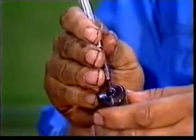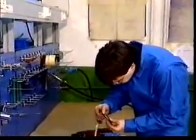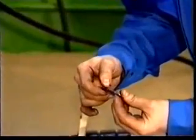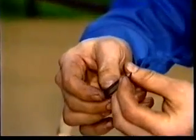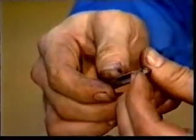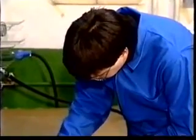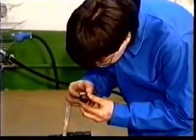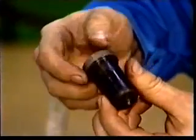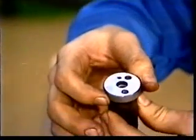Checking of the nozzle. Check the nozzles visually, especially for impact or a scratched needle seat face, worn or damaged needle pins, damaged body seats, nozzle tips damaged by corrosion, clogged nozzle orifices, scratches or seizures on the needle sliding face, and the sealing face against the nozzle holder.